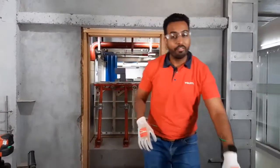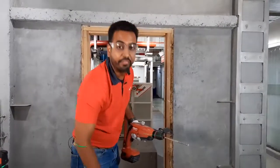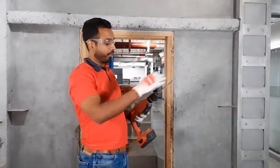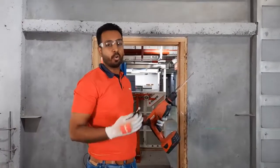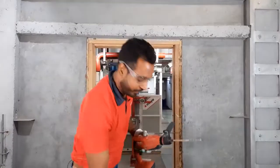Once you align the door frame, the next step is to drill to install the anchor. Today we are installing the HFV 10x120, which means the anchor length is 120mm, so we will be drilling to 140mm — because it's always good practice to drill 10 to 20mm extra beyond the anchor length. So here we go.